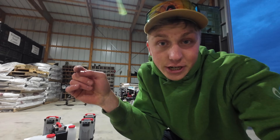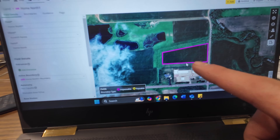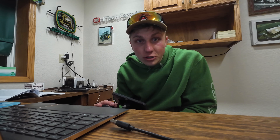If you want to see that trailer setup process, hit subscribe because that's coming very soon. I can show you on the computer — XAG has this online platform similar to John Deere's. I come into our John Deere account, select the field I already mapped with our gator, go to boundaries, and export it as a shape file. With the shape file downloaded, I import that to XAG's online website, which then syncs over to the remote controller for the drone. This saves me the hassle of flying the drone around the outside edge of all the fields so the drone already knows exactly where to spray.